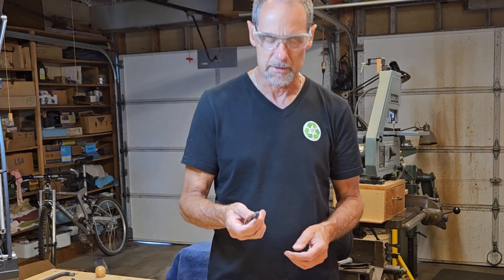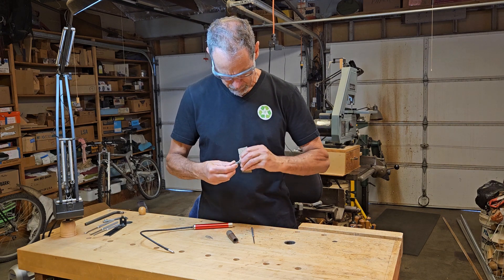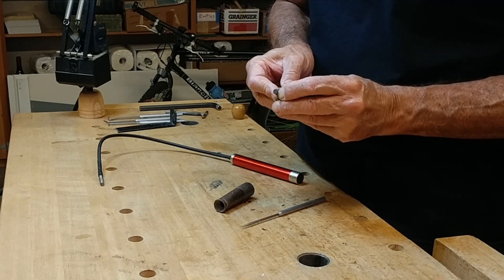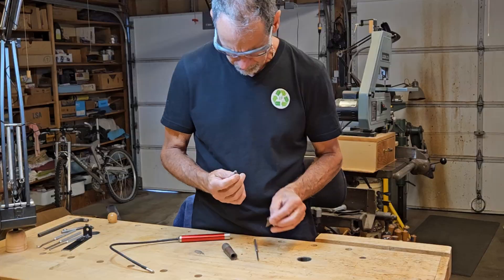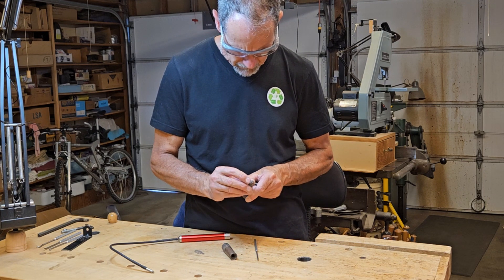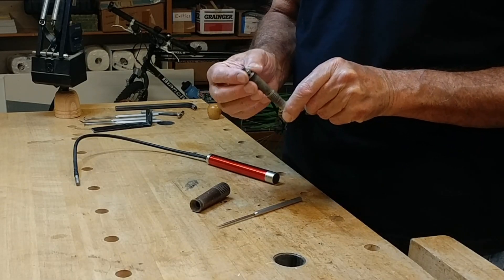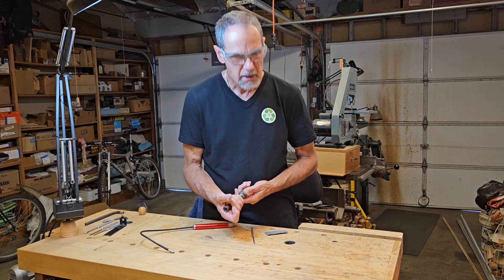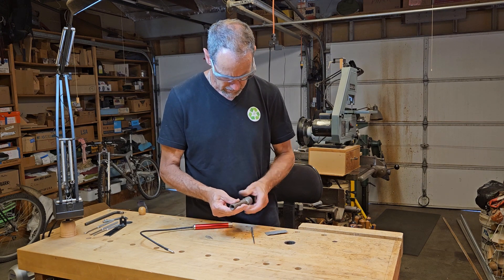About the best I can do, I think, is to try to clean this off. If I take a little emery cloth and just burnish this a little bit, see if I can clean that up and make a nicer surface. But I have a feeling that this just is not going to seal again. It's just too worn. It almost feels like there's a little groove that's been worn in there from years of use. We'll put it back together and give it a try, but I have a feeling this isn't going to work any better than it did.